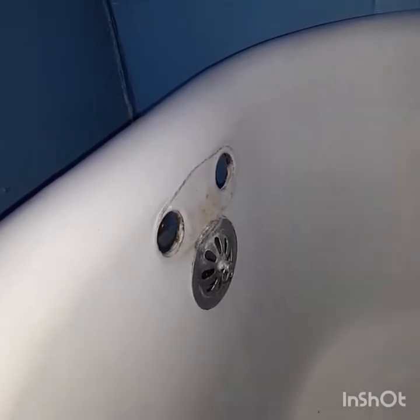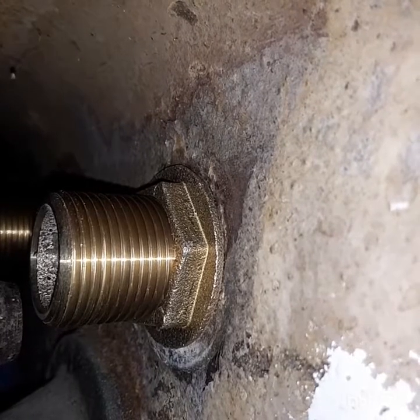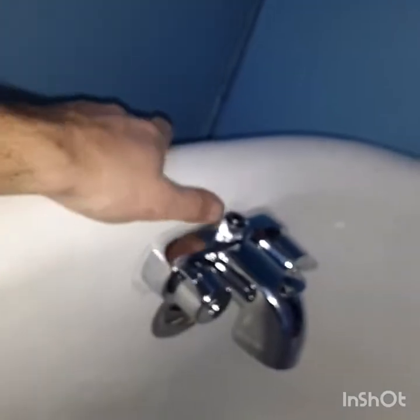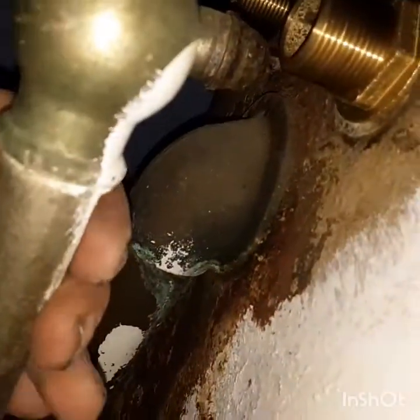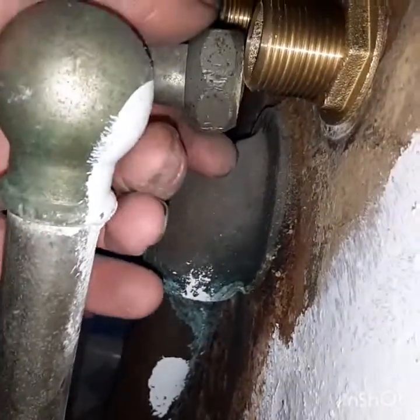So shiny! I got that on. This is cast iron — ding ding bong. When I put my threads on, I tighten them but I'm not trying to crack the cast iron. Don't crank on these things or else you're calling somebody for a new bathtub. It's just holding this on — it's not a leaky thread situation. These threads are not the ones you need to crank.